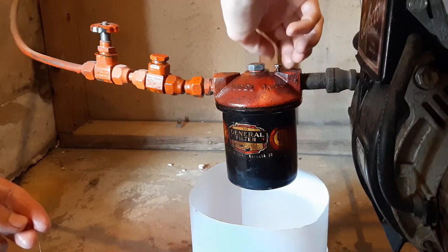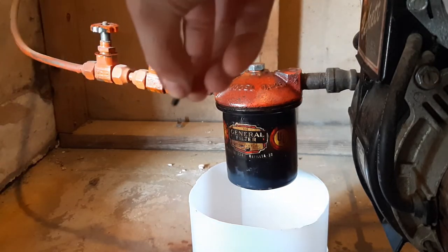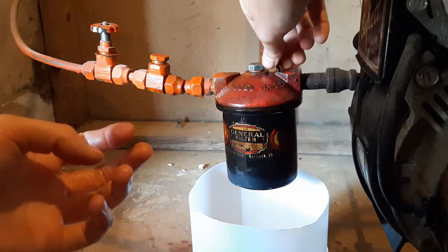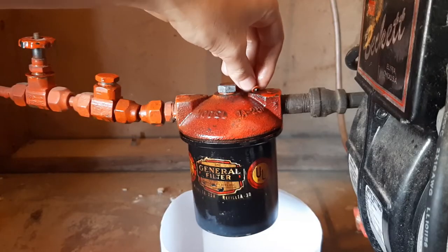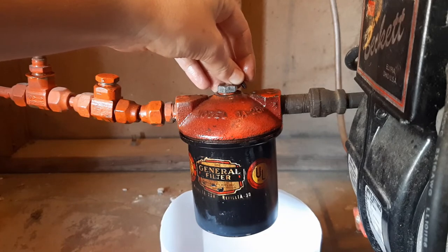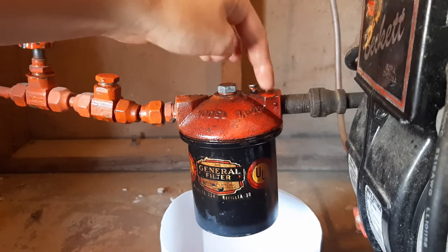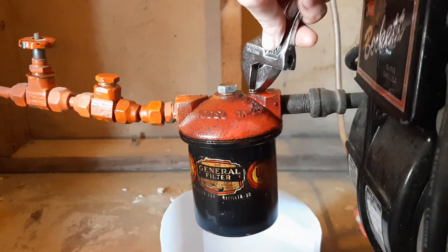The fuel oil filled that bowl real quick. If I change that gasket out before the bowl fills up, we'll be good. And there it goes — flowing freely now. So I'm going to plug that back up; there are a few more air bubbles. Tighten that up.